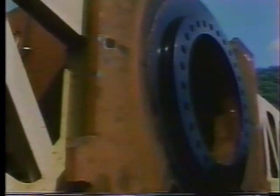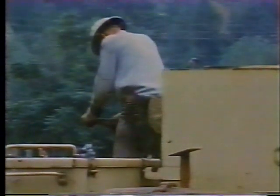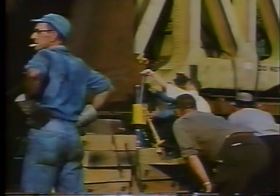Meanwhile, other parts began to arrive by rail from the fabricators' shops. The hub of the yoke was among the first. This piece, which bolts to the north end of the polar shaft, required a special railroad car to bring it from East Pittsburgh to the siding at Bartow, West Virginia. It was desirable that the yoke hub weldment be fabricated in as large a piece as possible and under controlled shop conditions in order that this 137-ton nickel steel casting, welded to 6-inch plate, could be heat-treated, radiographed, and then precision machined to fit the sphere.